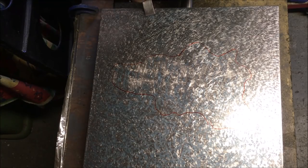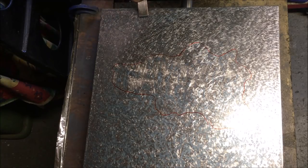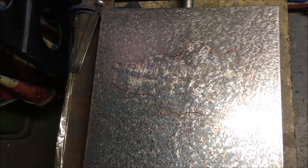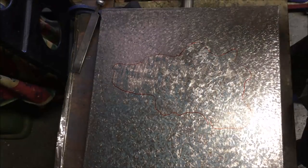Another thing, a note off Robin's video was he uses a precision ground flat stone, which he produces himself on his surface grinder with a diamond wheel. The advantage being that stone only cuts the very highest points off, doesn't dig in, doesn't score. Whereas mine's a bit, I think crude would be the nearest description. Right, I'll flip it round and do that half of the stone and then go over the middle. Bring you back when we're ready to progress.